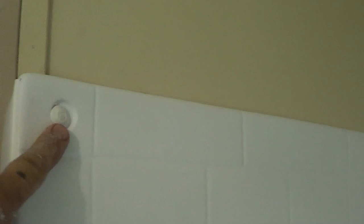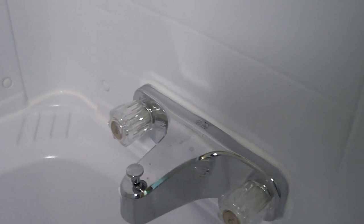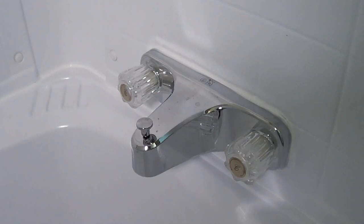We finished putting in the tub. It is a little difficult here and there, but these little pins help — you drill the holes, push the pin in, it spreads out a little bit and holds it from the wall. Around the base the client likes to see caulk at that edge — the tub goes up under that about an inch and a half so water doesn't really get in, but it's a good idea to caulk it. I like to caulk the top and sides of the faucet, but never the bottom — if water gets behind the wall you want it to be able to drip out from underneath. Thanks for watching how to install a bathtub.